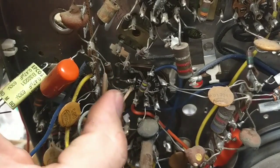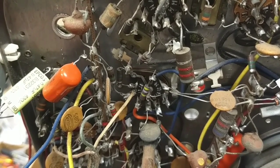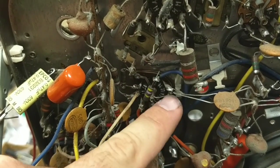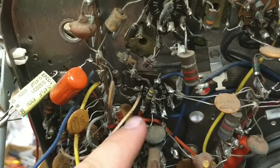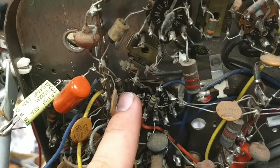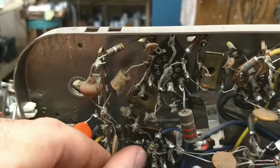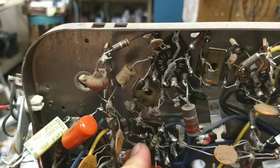And the way that you're going to count the tube sockets, I believe this is pin 1, you go in a clockwise rotation. So 1, 2, 3, 4, 5, 6, 7, 8, and then 9. So here's that 1 meg resistor that we were looking at on the schematic diagram, which then goes back to the video detector. So this pin here, this is where you would want to attach your video signal, right at pin 8.